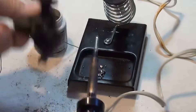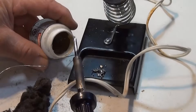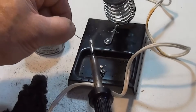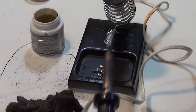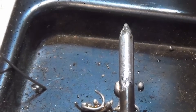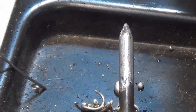Keep wiping it clean. There we go — starting to catch. Look at how shiny it is on this side, but not so much on the other side. So we'll dip into the acid flux. This acid flux is only used for this purpose — to get the iron tinned — and this will make the tip last a little bit longer. There we have a perfectly tinned tip. Let's zoom in on that. It's properly coated all the way up the tip, and this will help make a good solder joint once we start soldering on a circuit board or on terminals.